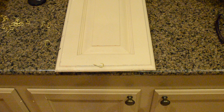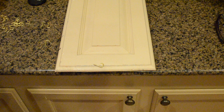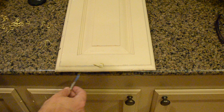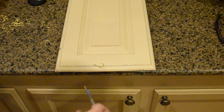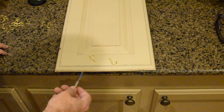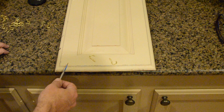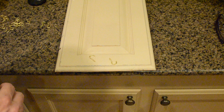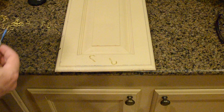The next step is to drill two pilot holes down in the cabinet door — this is the bottom of the door since this cabinet goes along the floor. I'm going to put two holes right here in the end, hopefully without breaking anything, and then mount two cup hooks into those holes so I can hang this door on a hanger. Following the Idaho Painter's suggestion, I'll put my holes in the bottom for floor cabinets and do the opposite for upper cabinets. For middle cabinets stacked on top of each other, I'll probably put that in the bottom too.